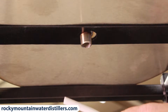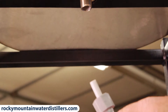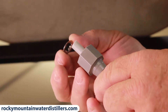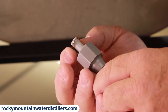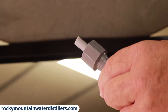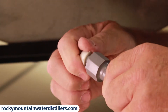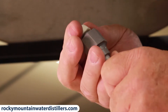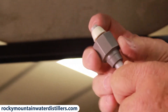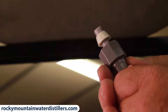The next thing you do is bring your tube over here and put your compression nut on it. Then you put your lock ring on. The proper way to put this on is with the flare sticking towards the end of the pipe so it's harder for it to come out — that actually bites onto the pipe. Then you put on a seal; it's a plastic seal and you want to push it up on that tubing, about like such.